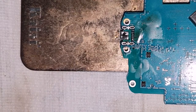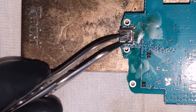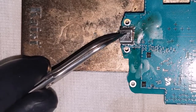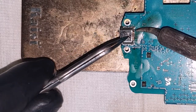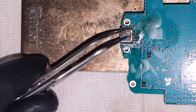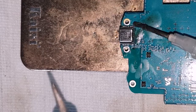Just a little bit on this ground pad — I don't want it going inside the port. Let's line the port up, place it there — that looks good. Let's hold it in place and bring in the soldering iron to line it up. I'll start by tacking these little joints on the side, then bring in the solder and flux to flow this area.